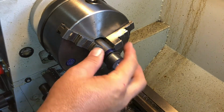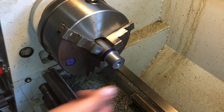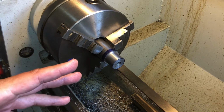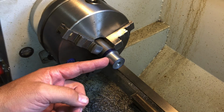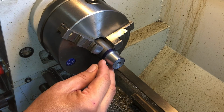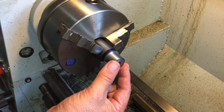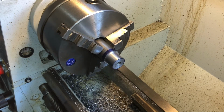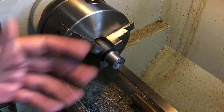And what I'm gonna show you is, at this point right now, when you're getting ready to thread your barrel, you have to do a thread relief. Say if it was a Mauser, you'd have to cut a thread relief in here, and you have to chamfer the end of your barrel, okay? So these are 2 critical things you have to do. That's what I believe, all right?